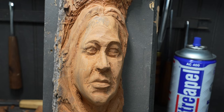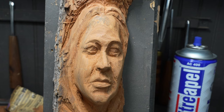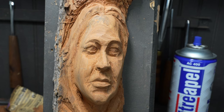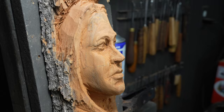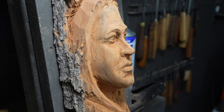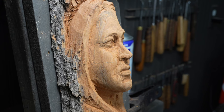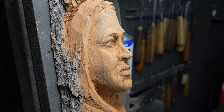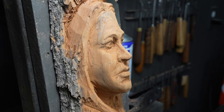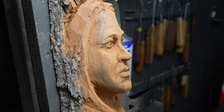In some cases I'll actually leave imperfections or cracks as long as they're not compromising the wood. But it's good to know how to hide the small thin ones. This is a pretty extreme example — if the piece of wood is that rotted, I may try to preserve it or make it part of the sculpture. You can also use a shim technique: if the crack is large enough, you can wedge a thin piece of bark into the layers with some super glue and accelerant, carve them down, and then use the sand fill method to fill any gaps.